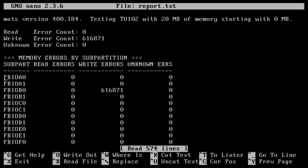So we got our memory channels. We got channel A, and it's 64-bit wide, usually a full channel. So I got chip 0 and chip 1 in channel A, then I got channel B, chip 0, chip 1, and so on. So you can see that it's getting an error on B0. So that's our chip. When we look at the card later, we can actually figure out which chip that is. But there we have our errors.